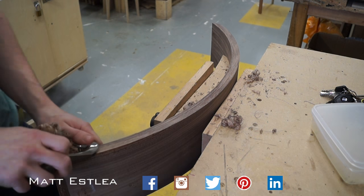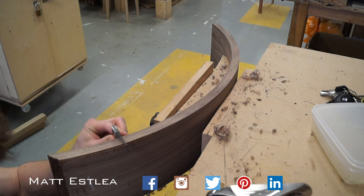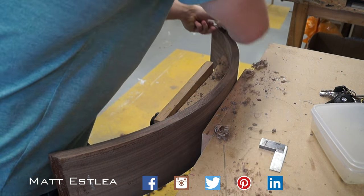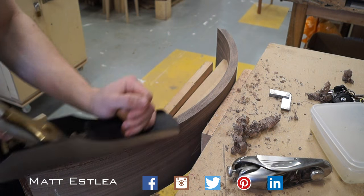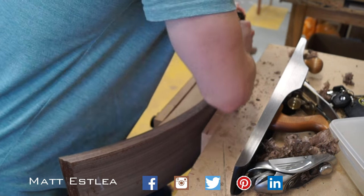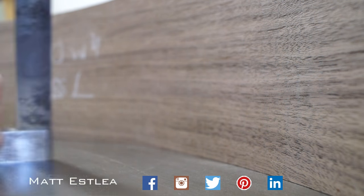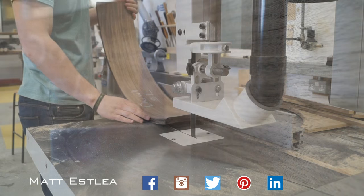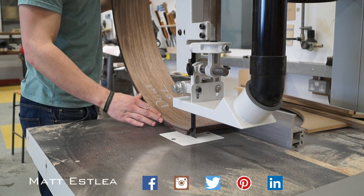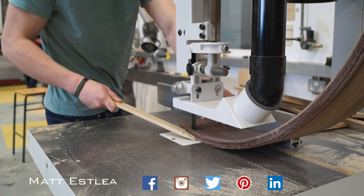Then I started planing one edge straight and square. You can do it on the planer but I was quite scared — that's like 50 quid's worth of material there and I didn't really want to be toying around with it. It's also quite fun doing it by hand. I just checked it for square as I went along, got rid of most of the material with the block plane, then moved on to the number seven, which I don't get to use often enough — I absolutely love it. Put a bit of candle wax on the bottom and you're away. Then finally on to the number four just to get into all the little divots. Here I'm checking the face is squared to the side using the planer bed as a reference surface. I used that flat edge on the fence of the bandsaw and cut it about three millimeters over the finish width, so I had room to thickness sand it later.